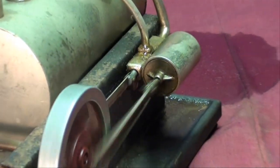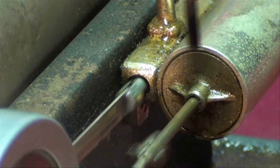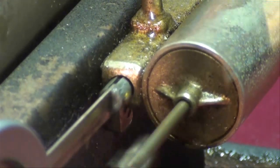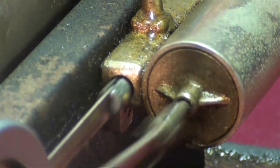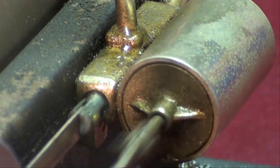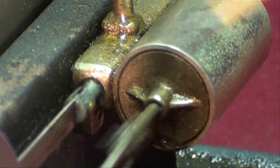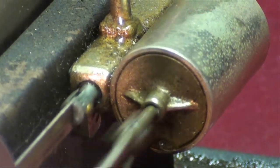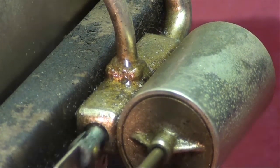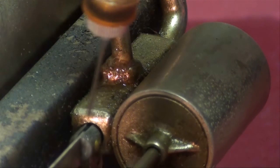but the view here shows you a little bit about the valve. That's a pretty good view there. Put your pointer on the valve, Jordan. No, that's the piston, the spool valve. Closer to the engine is the valve. Is it right here? Yeah, that's the valve. And there has been a repair to this years ago, and not a very good repair right here. There's some soldering or something going on that isn't very pretty.